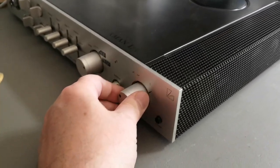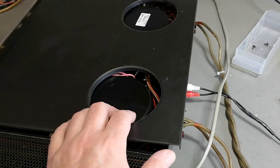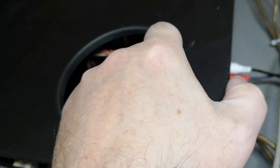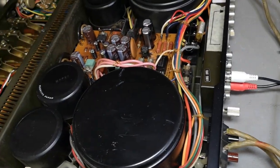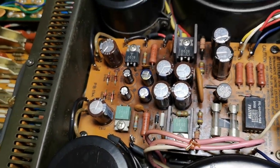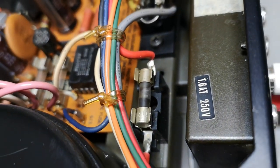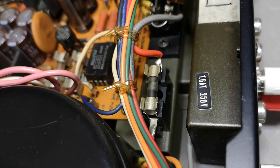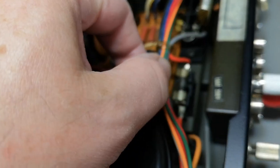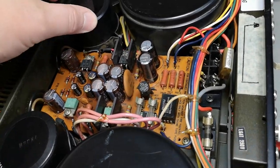I've been poking around with everything here, so it is time for teardown and maybe a little bit of repair. There's a rubber gasket all the way around here — when you lift the lid up you get in, and it's nice and tight. The power supply is nicely recapped. And there's the fuse — it looks a little bit smoked. There's definitely something wrong; there's always a reason why a fuse blows. We'll put in a new one and use the variac, cranking it up slowly to see what's to blame.